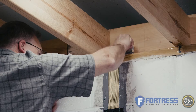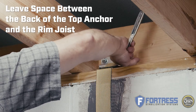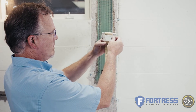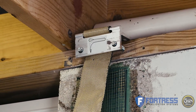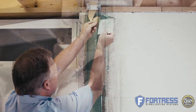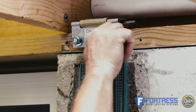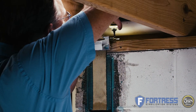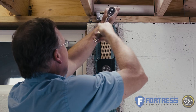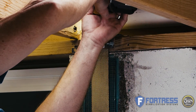To post-tension the anchor, finger tighten the nuts and then make two to three turns with your wrench until the strap is tight. Do not over tighten — there should be space between the back of the anchor and the rim joist. If using a sill plate anchor, you can now attach it. Follow the directions on the front sticker to wrap the strap around the back of the anchor. Place your top anchor on the hanger bolts and loosely attach the nuts. Pull the strap down and out, apply epoxy to the back of the black pad, and attach it to the strap. Allow epoxy to cure just like the rim joist anchor. After curing, use a right angle drill to install the two top screws leaving about a quarter inch gap between the top of the sill plate and the anchor. Tighten the nuts on the front until the strap is tight, leaving a gap between the front of the sill plate and the anchor. Tighten the top screws and installation of the anchor is complete.